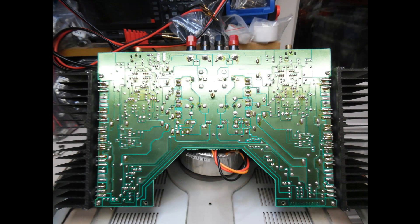The other thing to consider are dry solder joints on the circuit board. Unlike Marantz where you're going to be extremely busy re-soldering connections, with Rotel amplifiers you don't tend to see a lot of dry joints. You'll get some discoloration on some of the power components, but because the amplifier is being fully recapped and serviced it's logical just to scan across the board and reflow any of those connections.